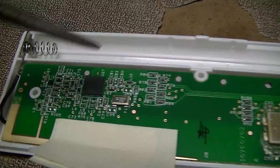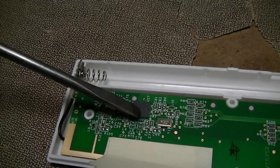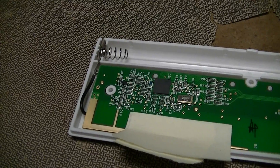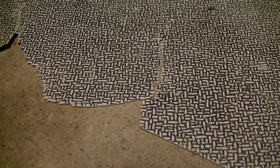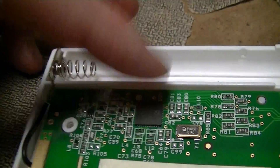It's going to battery contacts. And this bit is the RF section — again, a bunch of passives. This chip is going to be an RF comms transmitter chip. Nothing really fancy there. The part number, I don't work for the chip maker, but it's an XE1203F1063, week 42 of 2010, and that's just a QFN package, I think.